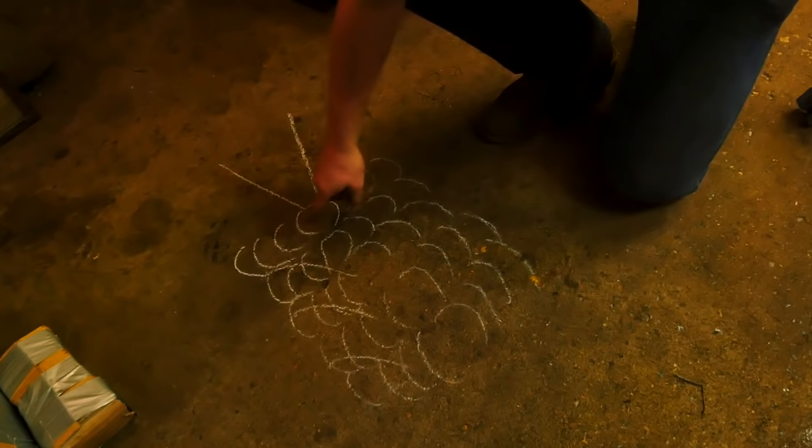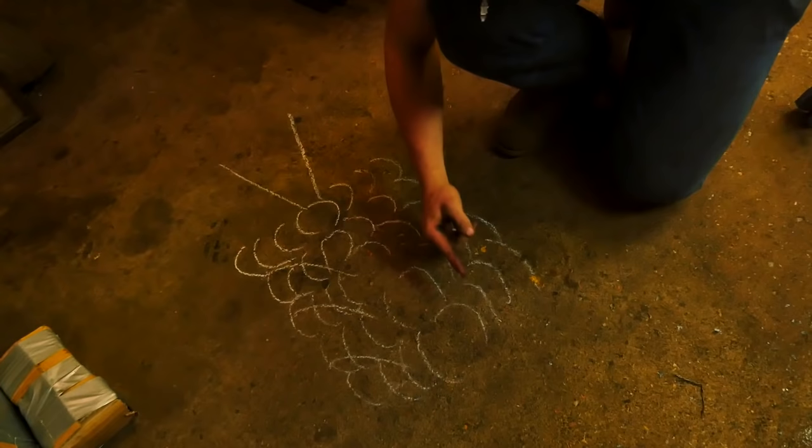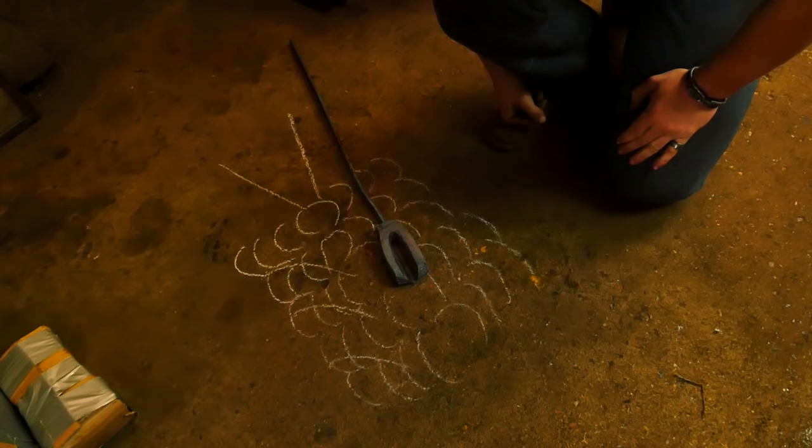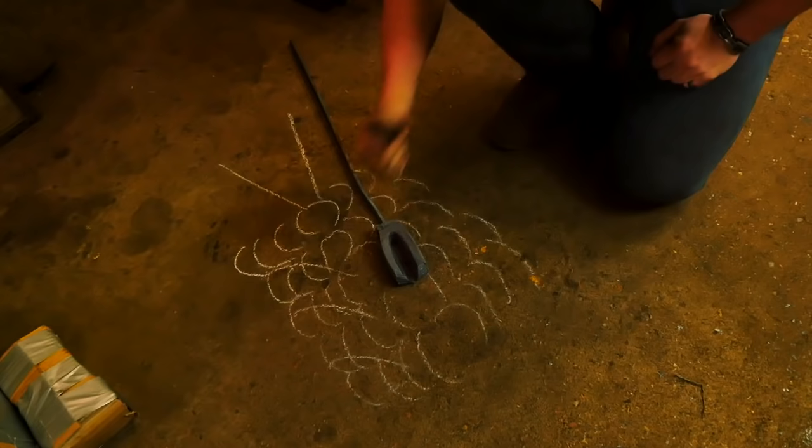These W's, and I drove a fuller down from the top, which hopefully is gonna make each layer just kind of bend and curl round. So now what I've got is this block, and I'm gonna cut it off on the cut-off saw right about here, grind out the inside, and then heat it back up and weld it back together. And that'll hopefully do this weird funky pattern that I can then do something interesting with. Pretty fun playing around and experimenting with this.